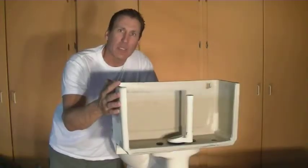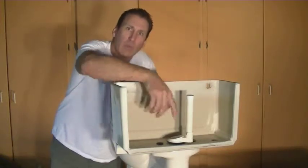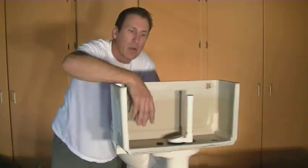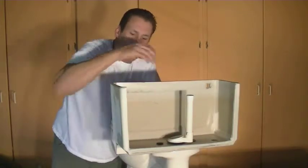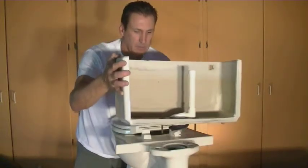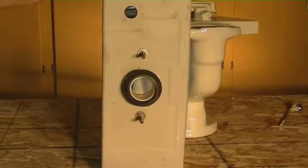As you can see now, we've got most of the toilet disassembled. We've taken out the handle, removed the flapper, removed the water intake. All the water has gone out of the bottom of the tank. We've removed the two nuts that hold the tank to the base, and now we can remove the tank off of it — it comes off that simple.